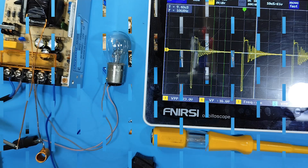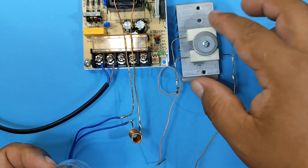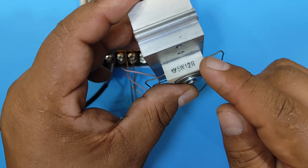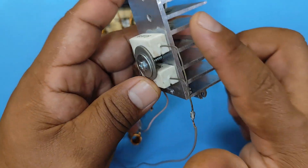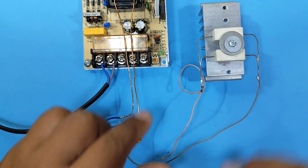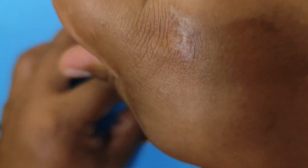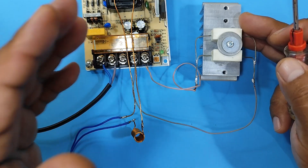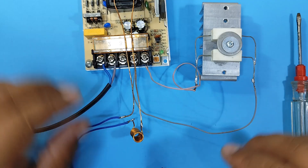Okay, let's test it. We're going to use two 12-ohm, 5-watt resistors — or preferably 12-ohm, 10-watt resistors. If you don't have 10-watt resistors, you can use two of this value and place them on a heat sink. Both resistors are connected in parallel and connected to the output of the power supply. The idea of the resistors is to force the power supply to deliver at least half of the current it can deliver. Now let's use a switch to turn our coil on and off. Now let's heat up some things.